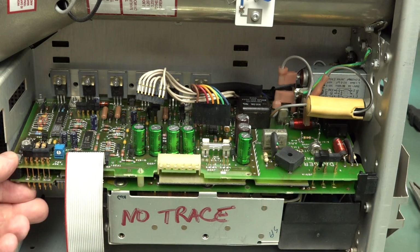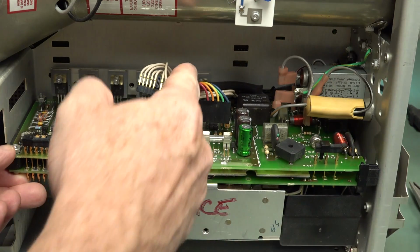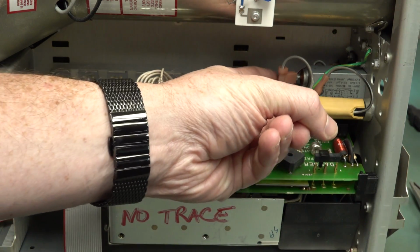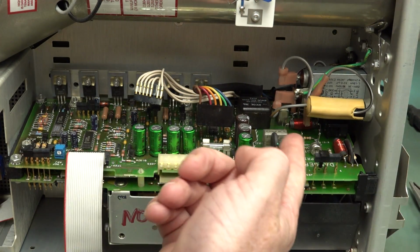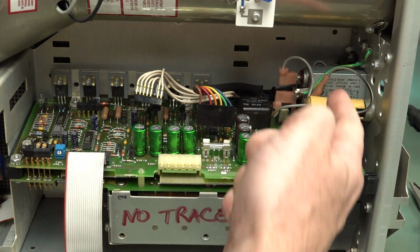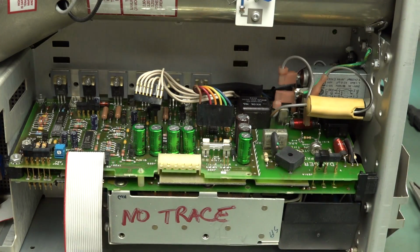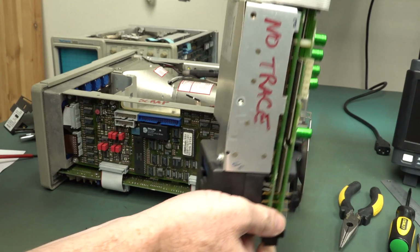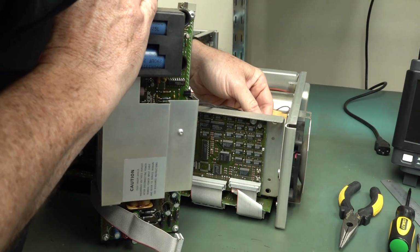I've got to say, getting this power supply out of here is pretty horrible. It does actually slide out if you undo some screws at the bottom there, but then some of the wiring, especially to the voltage selection switch on the back, they've got little spade terminals that have to be lifted off the board in this direction, but they're hidden behind here, and to get to these, it's a mess. Don't like it. Ta-da! I've got a big strapping earth lead there.